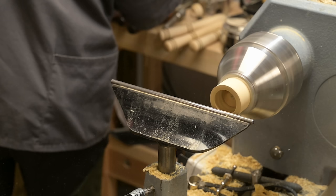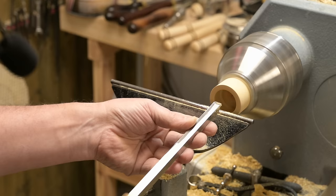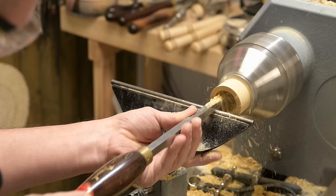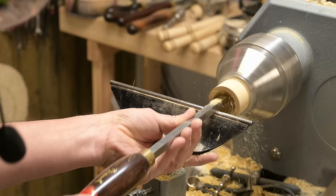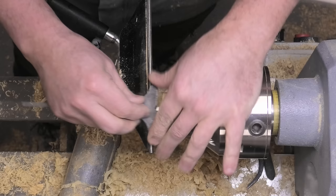Once I've done that I'm going to just eat out the bottom a little bit — remember there is a hole from that Forstner bit that needs to go. Check the size — now we're starting to get there, I think probably one more cut. Now, a little bit away from the bottom, we're going to use Jason Breach's signature box scraper. This is perfect for getting right in at the bottom before putting the thread in, shaped neatly with a nice radius corner. I can not only plunge down but once at the bottom it gives you that nice contour. Negative rake too, so it's going to get a really nice finish.